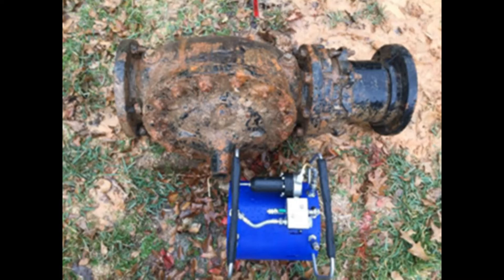An 8-inch traditional PRV is going to weigh about 500 pounds — their version is 50 pounds. A 4-inch old-fashioned PRV is about 140 pounds — their version is about 25 pounds. So there's a much bigger difference when it comes to weight, and having this flexibility in the field especially when you have to bypass is a major advantage.